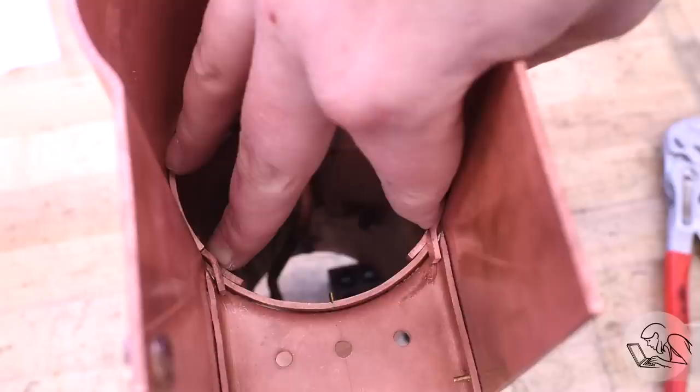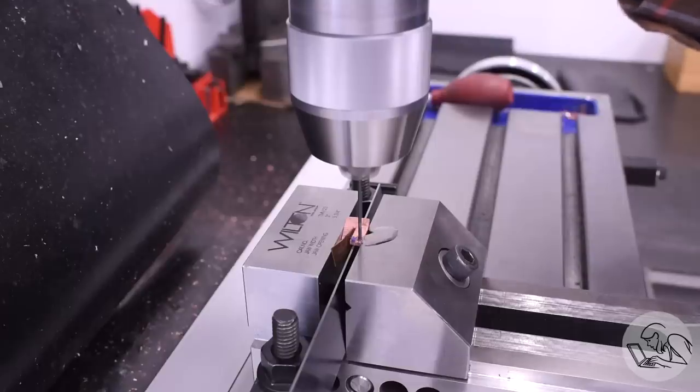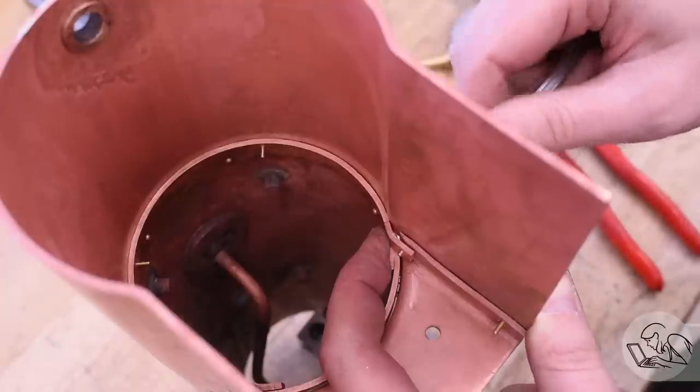If I hadn't lost sight of that, I would have realized the real problem — the rivet ring that joins up with these pieces is still too long. There isn't enough clearance for the Y-pieces to bend down at the correct angle to cover that little corner area. I also should have spent more time at this stage fitting the throat plate — you can see little daylight gaps that really shouldn't be there. At this point it was kind of too late because the brass screws had already been tapped, and if I tried to reshape things the threaded holes weren't going to line up anymore. This is not my favorite aspect of the design — I think the little triangle area could have been eliminated much more easily just by leaving the throat plate a little taller and fitting it with a little filing. I proceeded to build it to the drawings — I used my scriber to transfer the holes for the screws and drilled it out by holding it in my little toolmaker's vise.